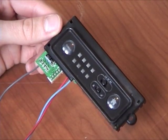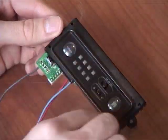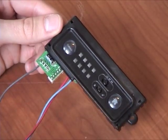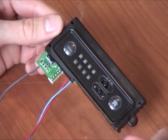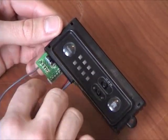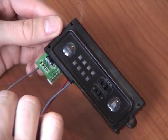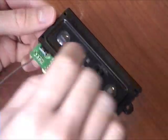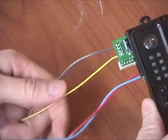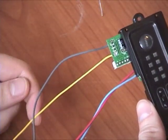It turns out there's actually one more wire we need to solder in here, and that is the USB connection to this board. There's some circuitry in here that makes the buttons not work quite right unless you actually have power going to it. So we're going to bring power in through the USB into the Akishop PCB and then bring a wire from that into this board here — just like the ground wire, solder in another wire for this USB connection. I'll show you where we need to connect this when we're connecting up all the other wires.